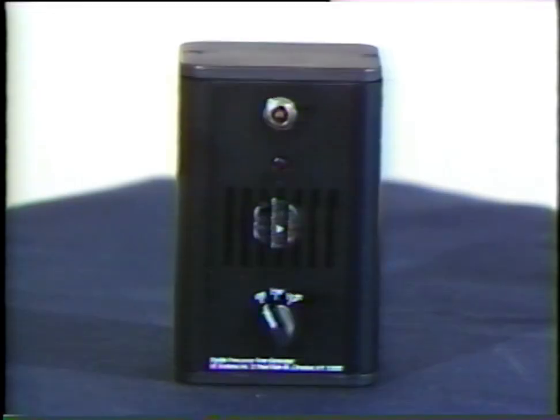The tone generator is an ultrasonic transmitter designed to flood an area with ultrasound. When placed inside an empty container, such as an aircraft cabin, it will flood that area with an intense ultrasound that will not penetrate any solid but will flow through an existing fault or void.